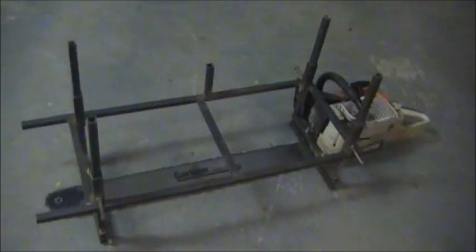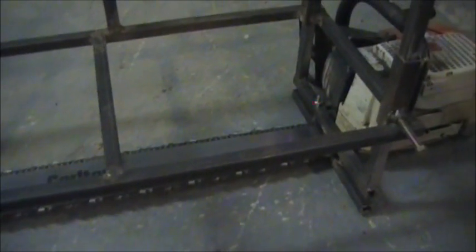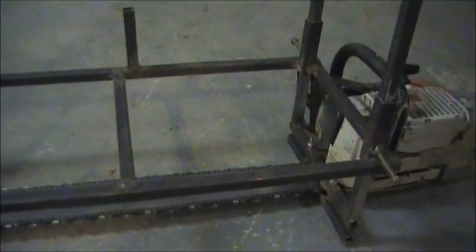When manufacturing a mill like this, there are several very important features to keep in mind. The first is the fence rail right here. This is basically just a glorified fence for a chainsaw, and this square rectangle piece must be perfectly square and flat. Otherwise you're going to have one surface riding on your tree and the other will not be contacting it correctly, which is going to result in an uneven cut.